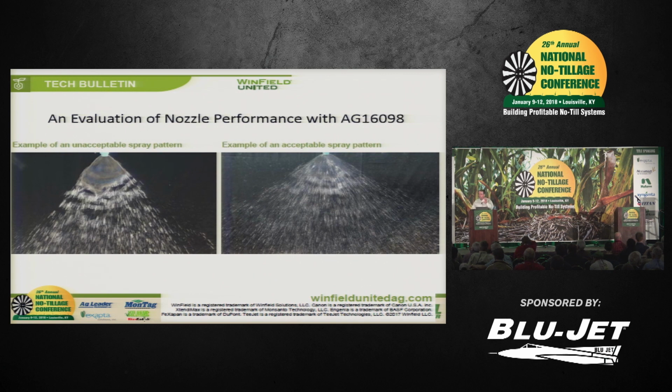Okay, another evaluation. There's a lot of buzz going around today about DRA, drift reduction additives. And this is really a focus on the dicamba talk, but it's good for this discussion as well. And this happened when the AI nozzle was first introduced, and we were putting low pressure plus a drift reduction material in the tank, and what happened to the pattern? It collapsed into a wet mop. And we learned that those will have an effect. So it's not all about drift control.